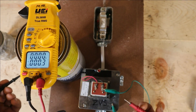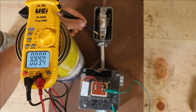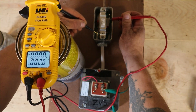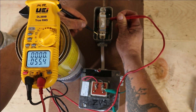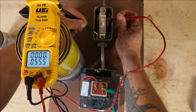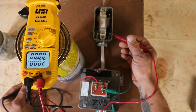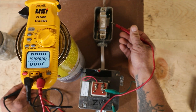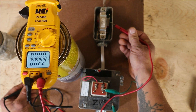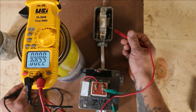Now sometimes a bad reading can actually tell you what the problem is. I'm going to take one of my probes, put it on the metal box, and take the other probe and put it on the powered terminal of the 120 volts coming in. And you can see my multimeter is giving me a weird reading — it's giving me 55 volts. Now if this box was properly grounded, I should still read about 120 volts there, but I'm not. So what is that telling me? That is telling me my box is not actually properly grounded.